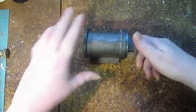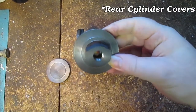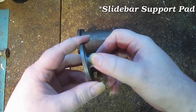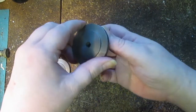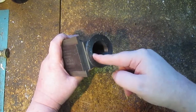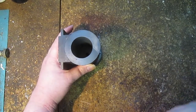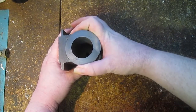First things first: Blowfly. Here's one of the cylinders and the front cylinder covers I've been working on. I still need to finish these up on the mill by cleaning up the sides and making the slide bar holding area square, then obviously drilling them so they can bolt on. The ports will need to be milled and I need to drill out the steam passages to get into the cylinders. You can also see just by looking that the actual cylinder bore is by no means concentric with the casting, which is a casting fault.